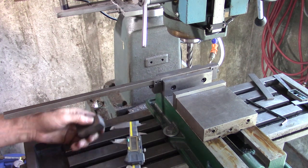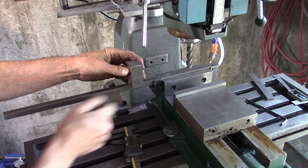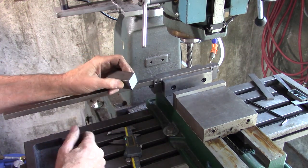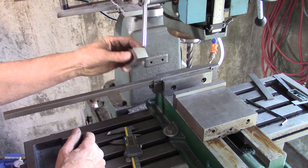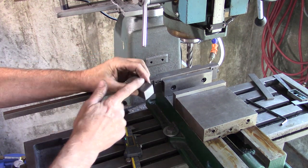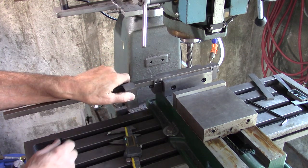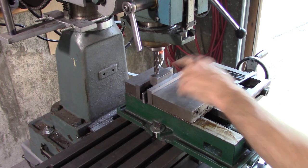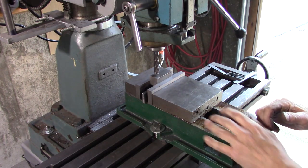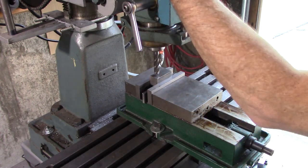This is a 1 inch block, and I want to cut a groove in there that'll be even with the face of that jaw right there. So I'm going to need to go 940 thousandths, no, 440 thousandths deep with my 1/2 inch mill to let that ride on there. Okay, I want to touch off on this, reset my DRO, and go 430 thousandths deeper.